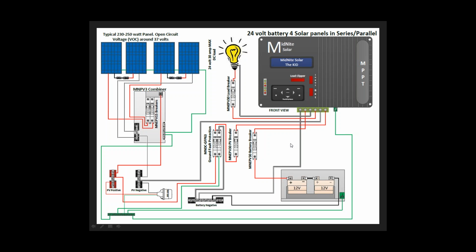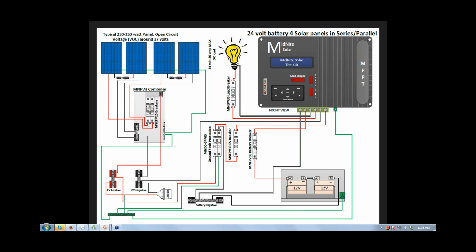Generally a ground rod. And I noticed that you have all your grounds going to one point there. Well, that's in most systems. That's typical to use a single-point ground system. Otherwise, you risk introducing parallel ground paths into the system. Uh-huh. And in a lightning-prone area, that can be, well, let's just say rather interesting. Yeah, and you get current flow where you really don't want current flow. So yeah, typically we use a single-point grounding system.